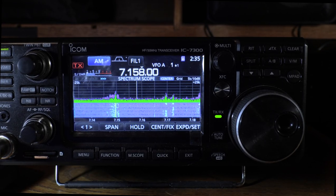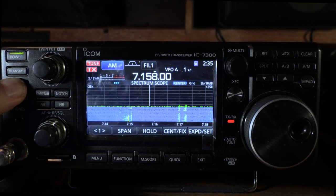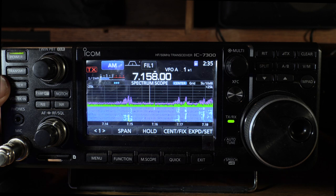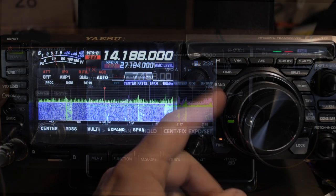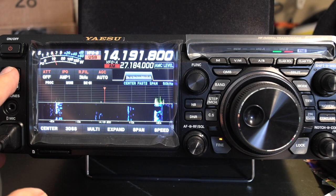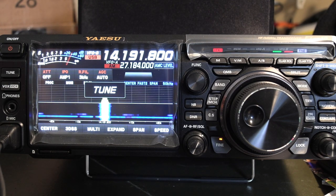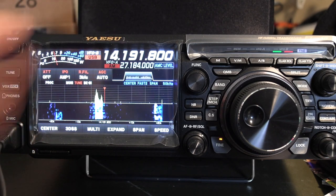The antenna tune-up procedure is really the same on both radios — just hold down the tuner button for a few seconds and it goes into tune mode. Neither tuner is happy with a greater than 3-to-1 SWR, though the 7300 has an emergency tuning mode selection that allows you to go a little wider. These are really for trimming an antenna that's slightly off. The antenna tuner has memories roughly every 100 kHz, so next time you go there with the tuner on, it's automatically tuned.